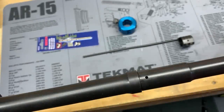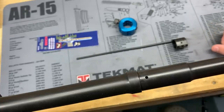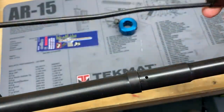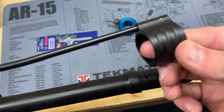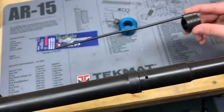Today I want to talk about how to properly dimple for a set screw gas block on an AR-15, LR-308, or AR-10 type firearm. This covers the dimpling procedure, how to do it properly, locking compounds, alignment, jigs, bits, and gas blocks. Dimpling is important for integrity and proper alignment, which facilitates proper function — preventing premature wear, function issues, or the gas block coming loose.